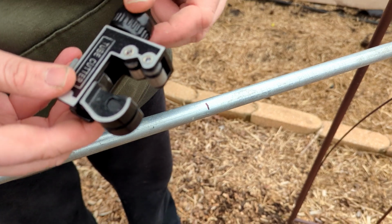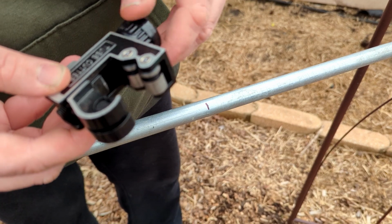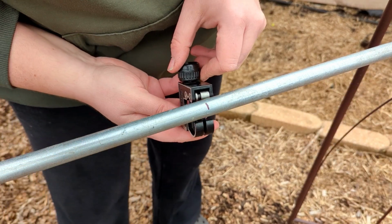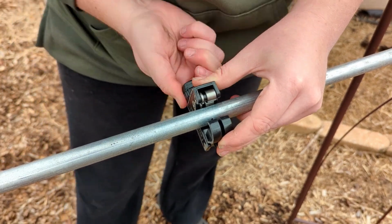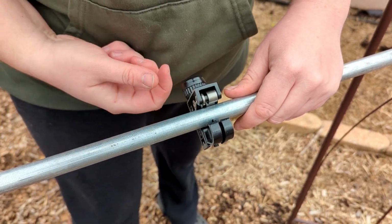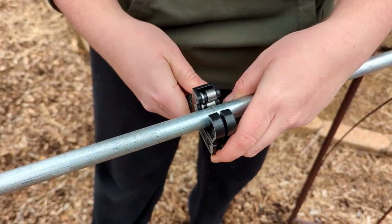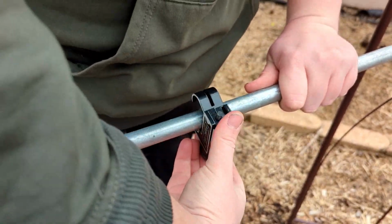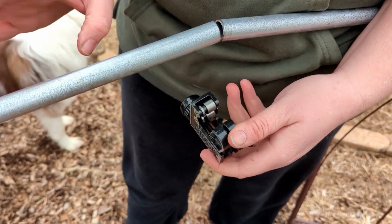So this knob on the end, when you turn it, it adjusts the diameter of the inside of the area you wanna cut. So I'm just going to open it up all the way. Okay. And then I put it where I want it, and then I just tighten it. And once it's pretty snug, you just start turning it. And after a couple turns, you tighten it some more, and then keep doing that until you cut through your pipe. And once your pipe is cut, you loosen that